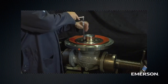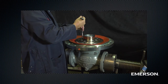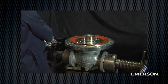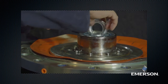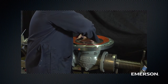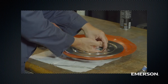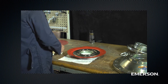Go to the upper spring seat. Unscrew eight special screws. Attach an eye bolt to the upper spring seat and lift up. Remove the sleeve assembly. Lift off the diaphragm and plate system and move to a stable work area. Remove the O-ring and replace if needed.